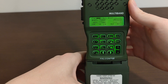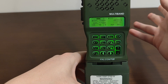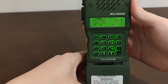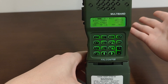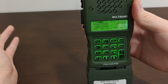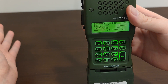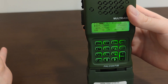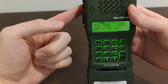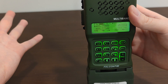There is no way to adjust the encryption key — no way to change the encryption or decryption key. So everyone with a TRI PRC-152 or TRI radio with CT mode enabled will be able to hear your descrambled voice. Because you cannot change the key, it's not truly secure, since a stranger with a TRI PRC-152 can eavesdrop — it's a universal key for pretty much all TRI radios.